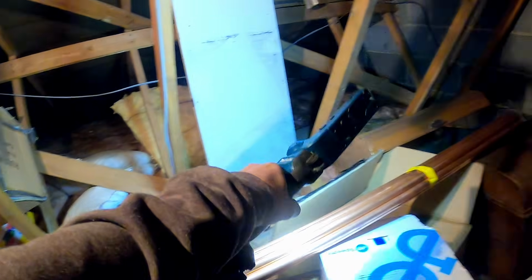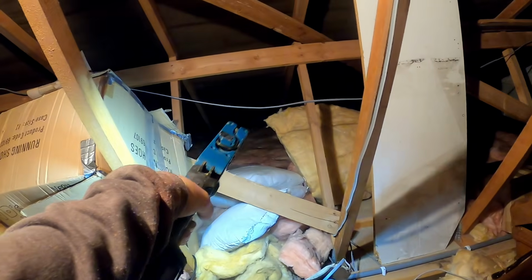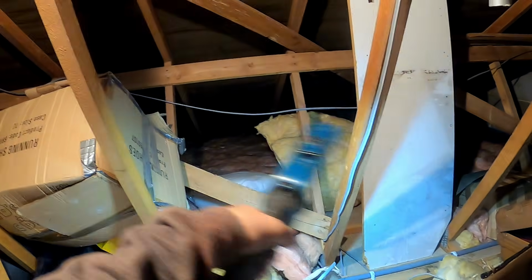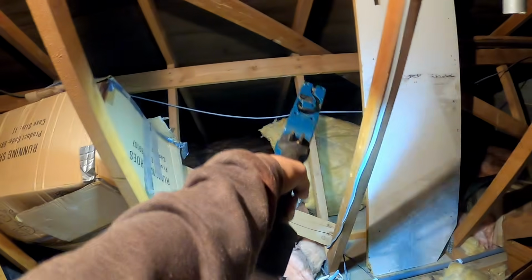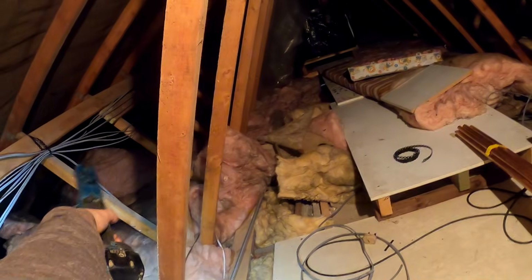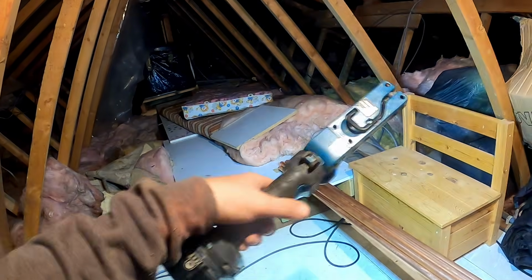What I'm going to do for a start is literally just get a flow return clipped along the whole length of the roof, because we've got radiators going in, but they're going to be really hard to get to. We're going to have to chase in the wall and fish pipes up, but they don't want to see any pipes on the surface. So there's basically radiators along that side. We've got one in that corridor down there. We've got a radiator in the bathroom here somewhere, radiator in that bedroom, radiator over there in the cloakroom, and then there's a radiator in the far end of the lounge. So yeah, I'll get flow return gas clipped along.